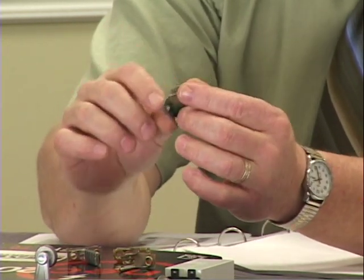But one second, if we're heating up something, then if it goes past a certain point, it will then open a contact. Yes, exactly. The heater itself that you just showed me, current can still go through it, whether the contact is open or not. So the heater is simply the ability to capture the heat and transfer it to something else, and that something else measures the heat and says, hey, we have a problem, and it opens a contact.